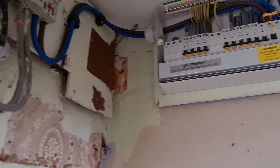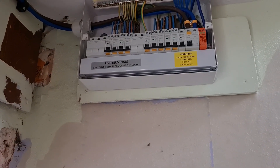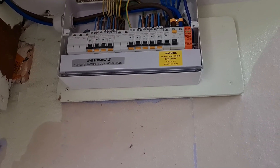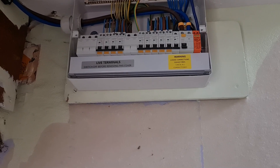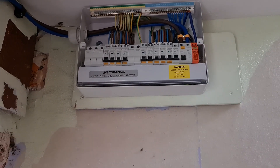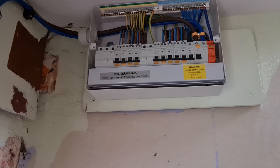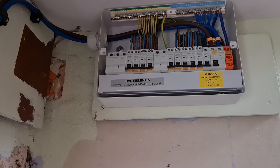Some people don't understand the purpose of the S-type — it's really just there to look after the tails into the board. It's 100 milliamp and time-delayed so it doesn't immediately operate. If you get an earth fault on a final circuit you want that protective device to have a chance to trip before the main switch operates itself. It's come up quite nicely.